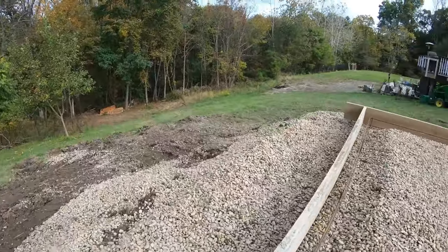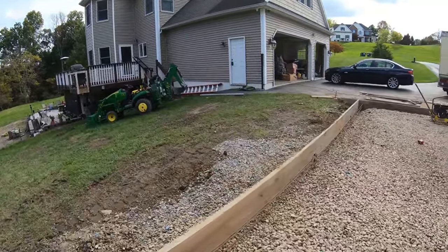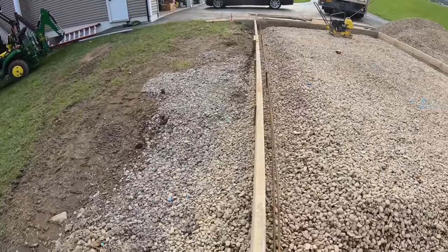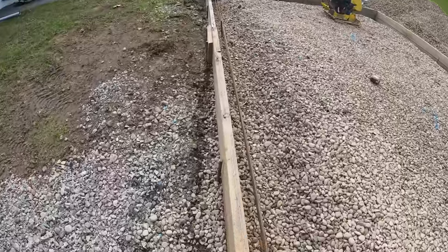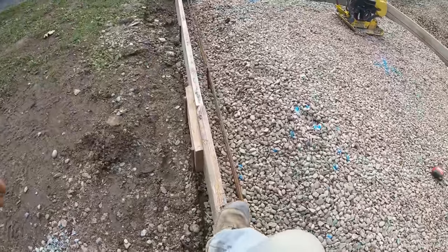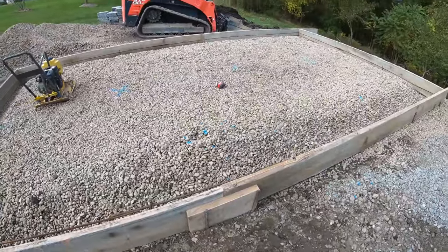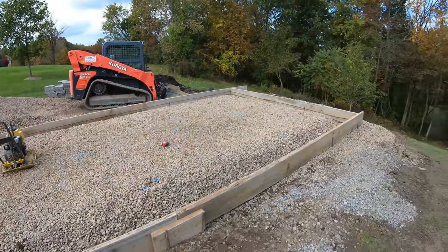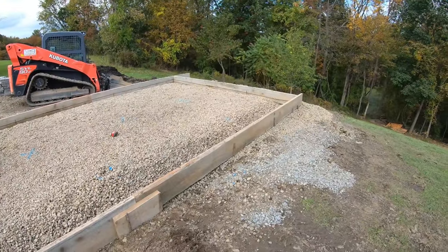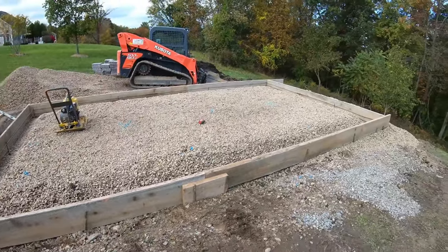Precision. So each string will have a preload on them, and you can see even on this board the board's bowing in, and it's a 1/2 to 3/4 inch in the center, and it will come out dead level perfect every time. And you could adjust that as you pour, just like you would a poured wall. You put in a brace, take out a brace. But if you don't preload that, it's too late. You'll never get it in. You'll be shoveling and everything else.